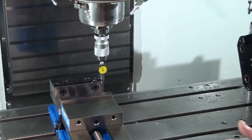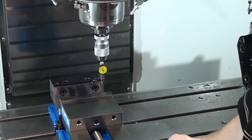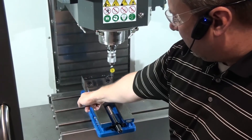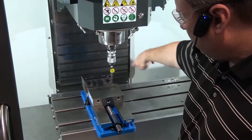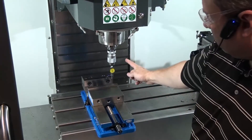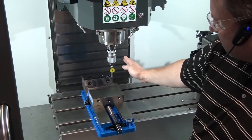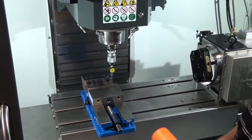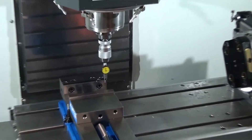The way to fix that is to bring this side of the vise forward by tapping this corner of the vise and rotating the vise clockwise. I moved it counterclockwise and I want to move it clockwise. So if the arrow starts to move counterclockwise, that means I'm further away. I come over here and tap — you can see that it moved about a thou.